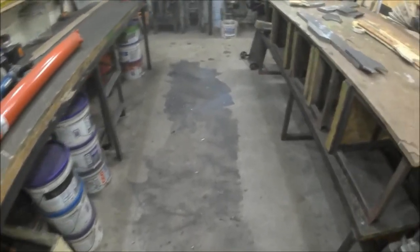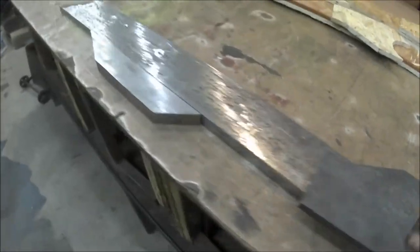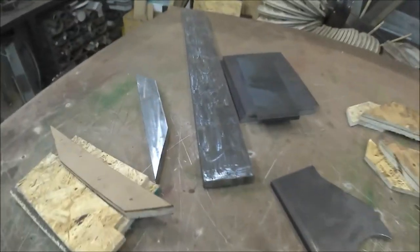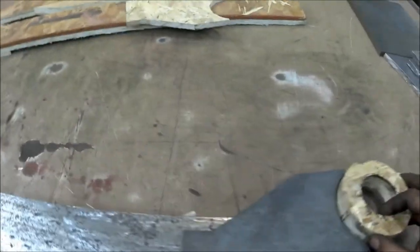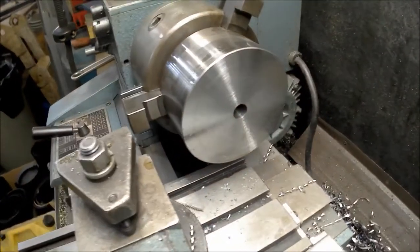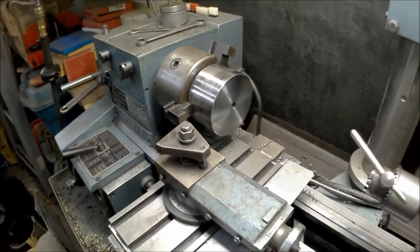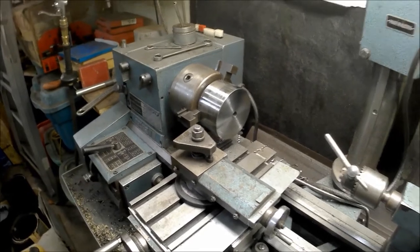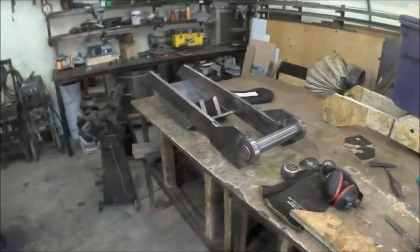The metal parts are almost done — they created quite a bit of dirt on the floor from all the grinding. Here are the pieces: two sets of course, then the braces across. Now I'm working on these pieces that fit right in there. I just drilled it to half an inch and I'm going to drill it all the way to an inch, then bore it to about two and an eighth inch for the pin. It's quarter to eleven at night.